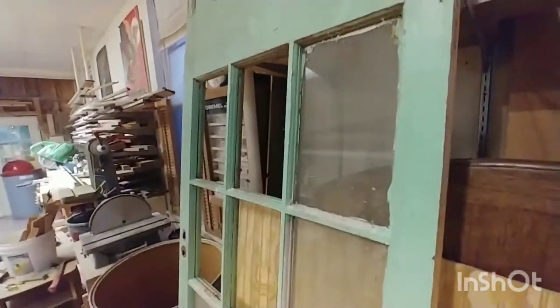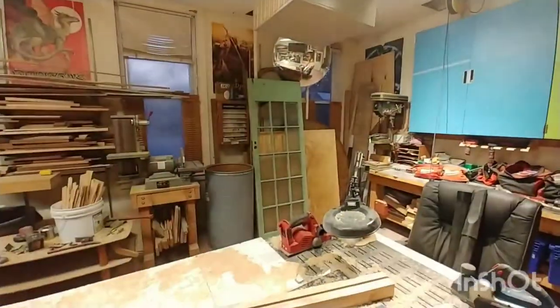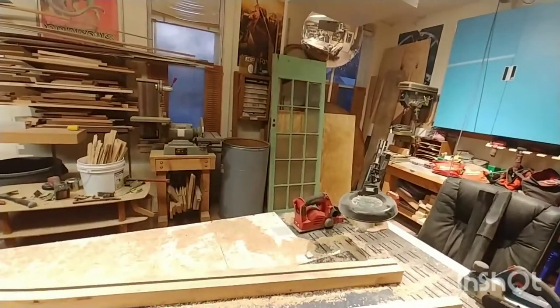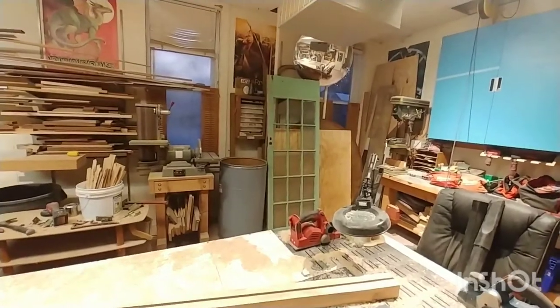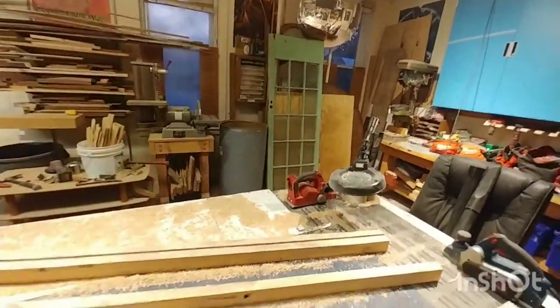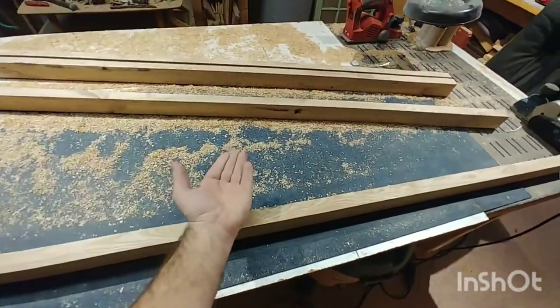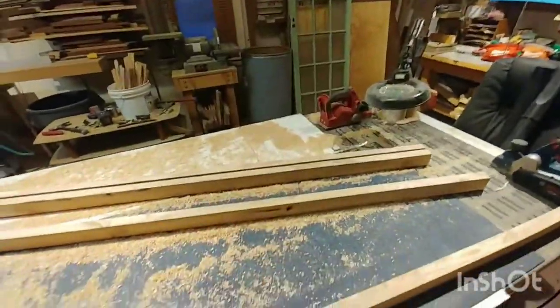By the time they get down through the extra material to the surface here, the route that it takes through there will be skewed, and then the door will be getting sanded all fakakta. So we're going to do what we can here, despite the fact that we've got a little more than we need in every aspect, so that we justify them all to one side so that we can send it through with that side up probably a couple of times and get to a point where we're happy with that being a flat surface. Then turn it over and put that down onto the track and let the extra overhanging meat on the other side come down. And then finally the drum of the thickness sander will engage the whole surface.